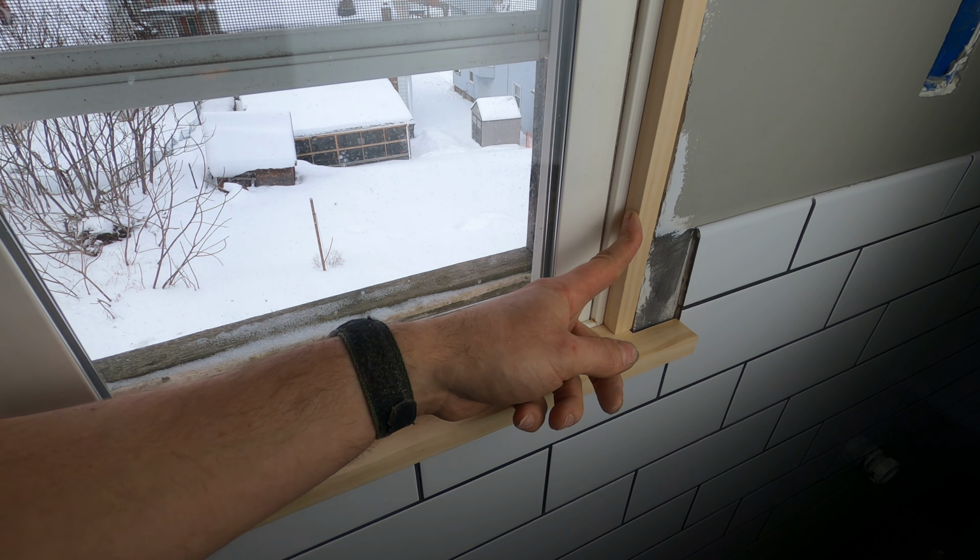The bathroom door is finally in, and I feel like I'm one step closer to a finished bathroom. So the closet is not gonna get a door, and this is why. I've been in a lot of older homes where the entry door was here, and right angle to it was the closet. Somewhere over that house's life, someone has tried to enter the bathroom the same time someone was trying to open the closet door, and the closet door got a giant scar across it from the latch of the entry door. I do not want that to happen here because the woodwork is really nice, and I wanted to stay that way.